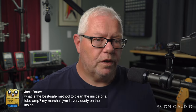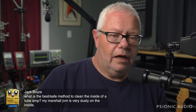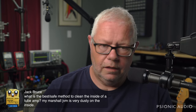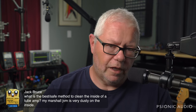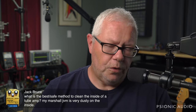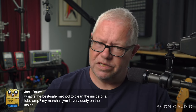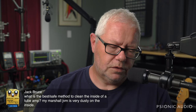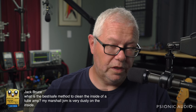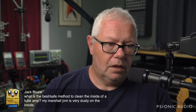Hey, Jack Bruce, if you want to clean the inside of your tube amp, take it outside and get a can of compressed air and spray it out, and it'll get all the dust out. Beyond that, the only thing that the owner needs to ever do is maybe, like once every 5 years, a little bit of DeoxIT followed by fader lube on the pots. Only when you begin to have any kind of scritchiness to it.